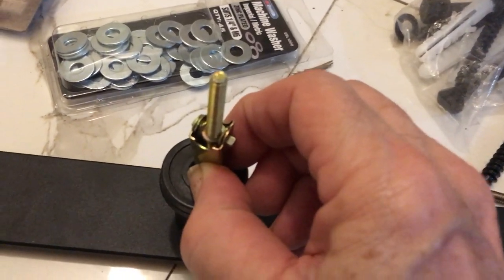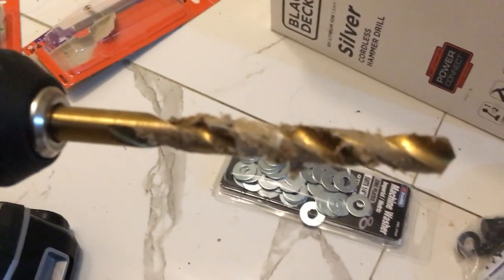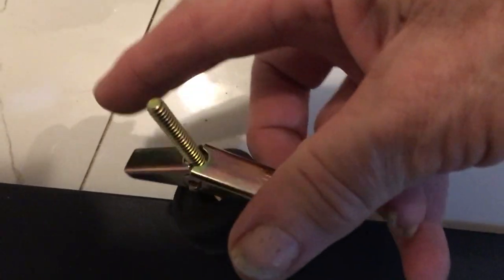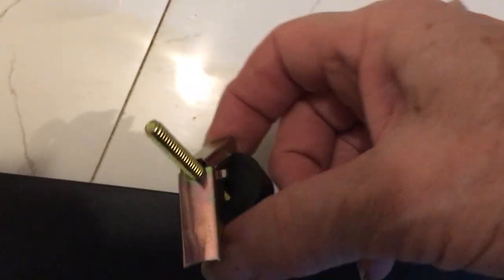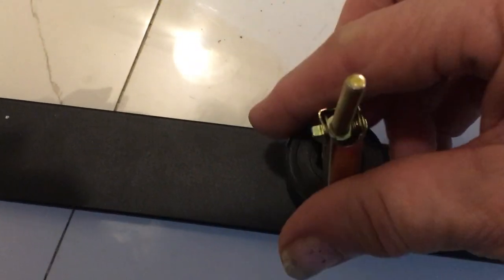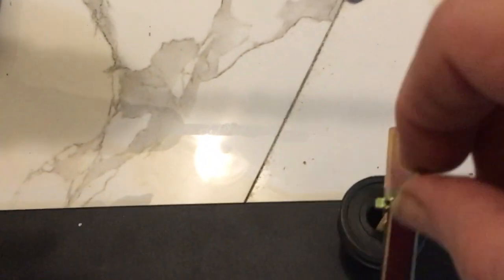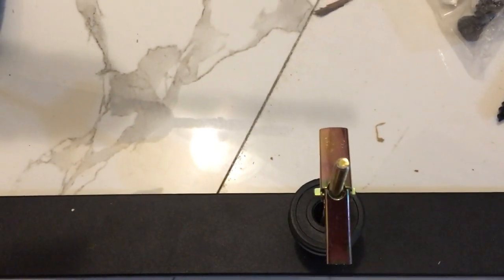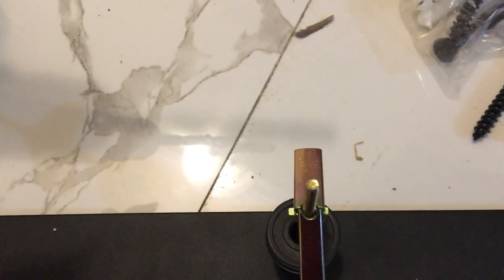So I'm going to be putting them all on to drill the holes. To drill the holes for the toggles I'm using a size 10 drill bit, because when you collapse them you need quite a big hole for the toggle to collapse into, to thread it through so that it can snap open. The height that you're going to be measuring to drill your holes into the wall is the height of your door plus 4.3 centimeters, or 43 millimeters — that's where you drill the holes.